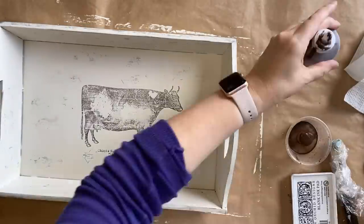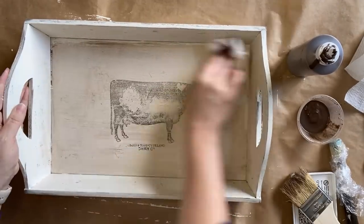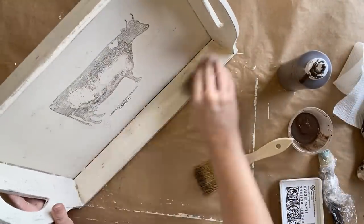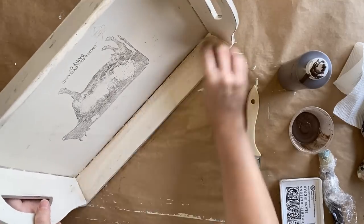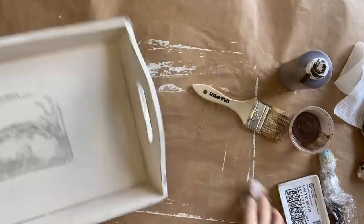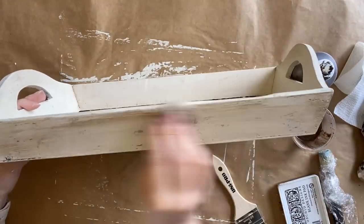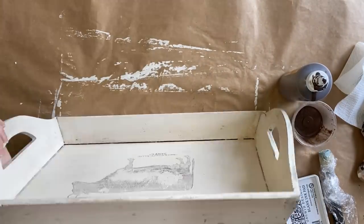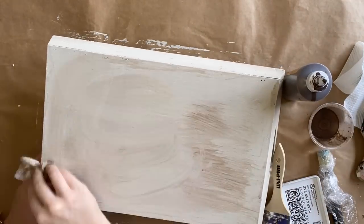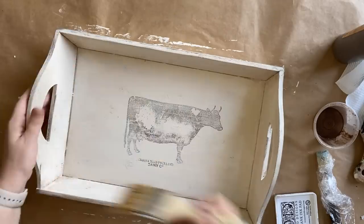To age this up even further I'm going to water down some of Dixie Bell's Tobacco Road Voodoo Gel Stain and apply it over the top of my silk mineral paint, then wipe it back. I also use a mister in certain areas to get even more of the product back. I want it to lightly tone the paint and I want more of it sitting in the corners and crevices of the tray to make it look like it's worn over time. You could definitely leave this step out if this look isn't for you — you could use a paint wash instead or even a brown wax. I'm applying the stain to the entire thing including the bottom, then almost dry-brushing the edges and corners to darken up those areas.